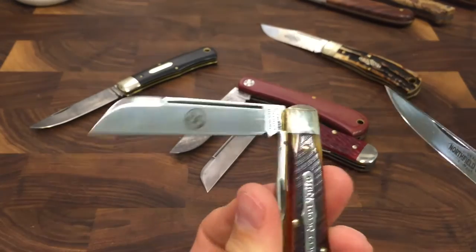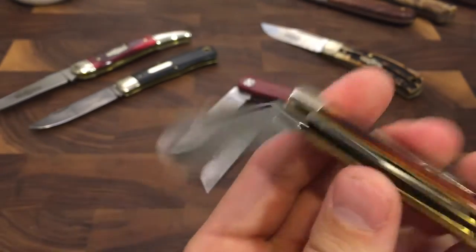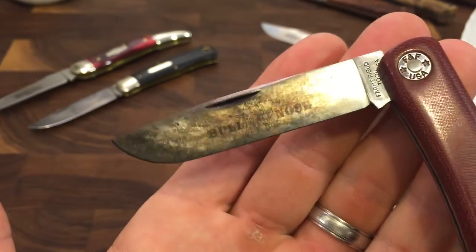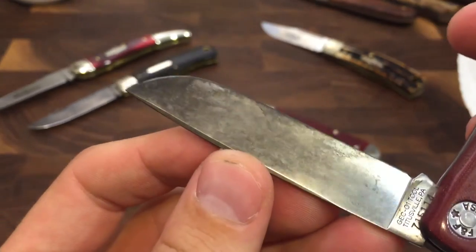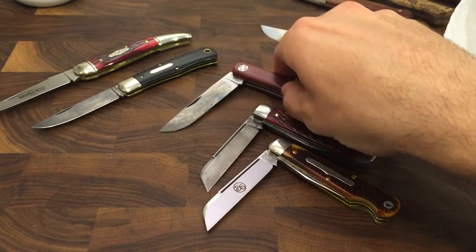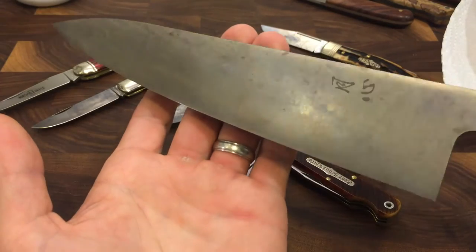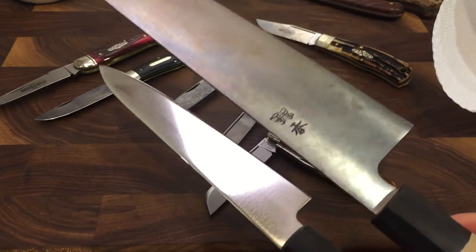The knife as you use it is going to get a patina because it's a carbon steel. The carbon is going to corrode quicker than a stainless steel — that's why they call it stainless. So if you were just going to use the knife, you may end up with a patina like this. This is O1 tool steel, it's a little bit different than the 1095. But you can see if the light catches it right, you can see some blues in there. This one I haven't done anything with, but it's Japanese blue steel — there's a dull gray finish to it now because it's carbon steel. As opposed to something like this, which is stainless — that stays nice and shiny.